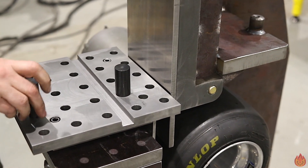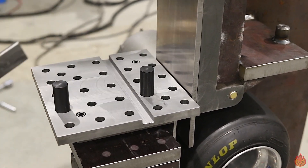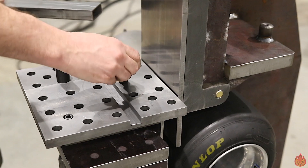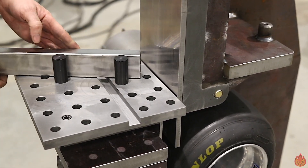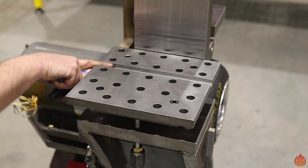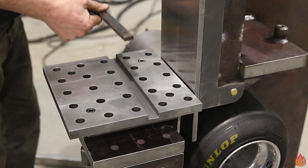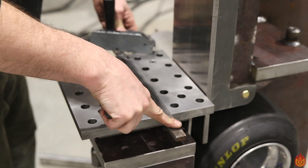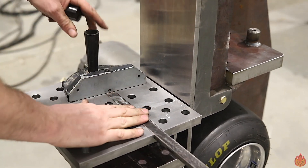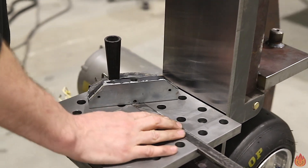It's because of this: if I wanted to grind a piece of material square, I could put these pins in here — now I can grind square to the table. If I wanted to do a 45, I can grind a 45 in there pretty easily. Move the pins over — there's a 60 degree, pretty slick. What happens if we want a custom angle? I took some inspiration from a table saw. We don't have a lot of table saws around here, but let's put this in — there we go. Now it works just like a table saw; we're able to adjust it to any angle we want, clamp it down, and grind in there too.